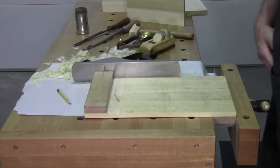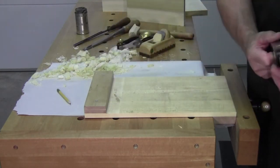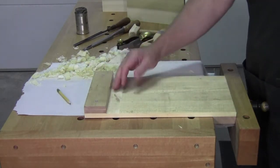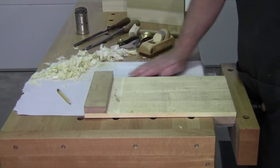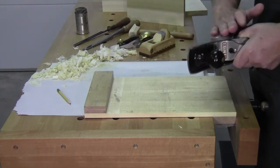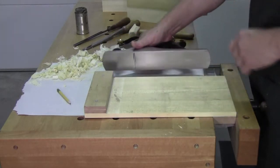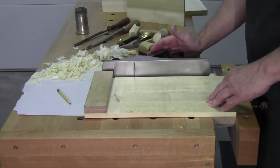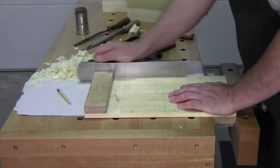for those of you who are joining us for the first time, what I do for a simple shooting board is I use my bench hook that is squared up, and I put down a piece of newsprint. You could use some other slick surface, and I put a little bit of oil on the cheek that lays down, and this becomes quite slick, and I don't scratch up, mar up, or ruin my workbench. So that's my simple shooting board.